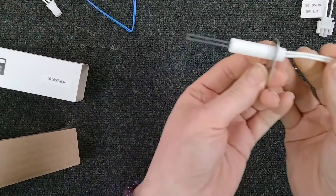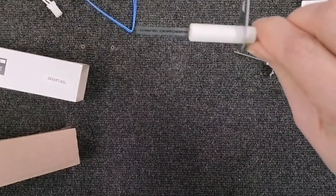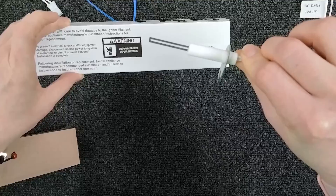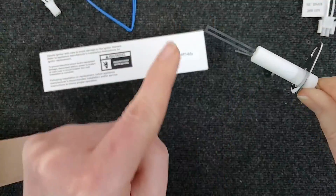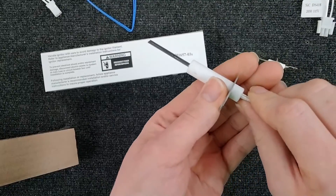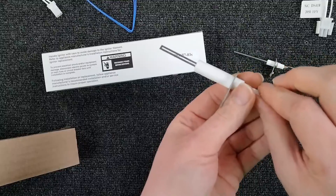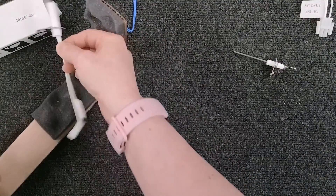The igniter breaks so easily that they've actually replaced the OEM with one that's far more sturdy. You can see this design was terrible — it's got these two weak little connectors that form a rectangle. People take this out to clean it because they've been watching videos about cleaning flame sensors, and then smash — when I say this thing is delicate, any little tap trying to remove it or take it out and it's done.